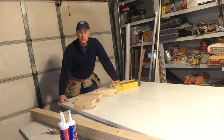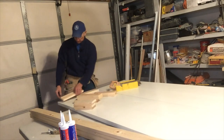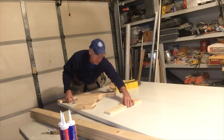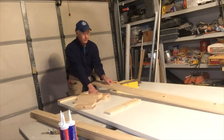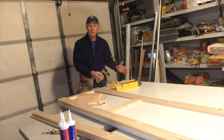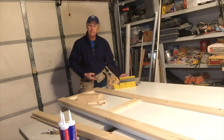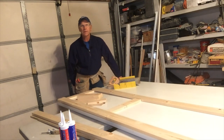Our next step is we're going to pre-cut some of the pieces. I have eight pieces here which will be our tops and bottoms. We have a couple that are cut that will be our middle style, covering up the screw hole for the old handle. Then we have four pieces that are verticals that'll be on each end of each panel of our bi-folds. I have a power miter box, but if you're a homeowner, a simple miter box from your big box store will do the same — it'll just take a little more time and effort.